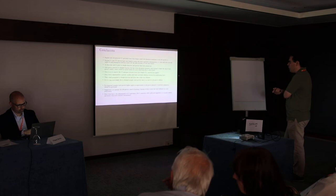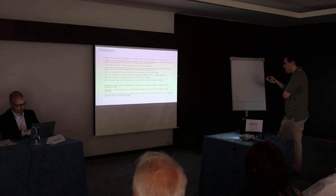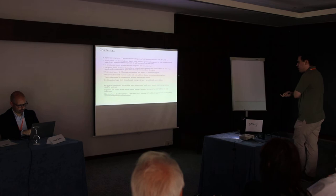But just to stress, try to use some different geometry, to try something else on these printed specimens, because we've shown that, because of some features on the printed side grooves, the crack just hides behind some printed layers. So the suggestion is to possibly machine the side grooves if you can, instead of printing them, because of these layers that could influence the crack observation.